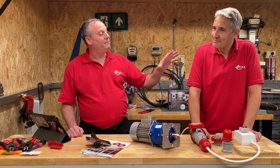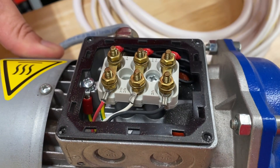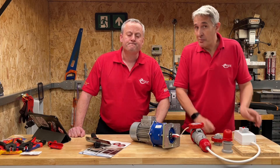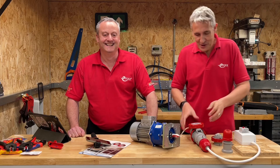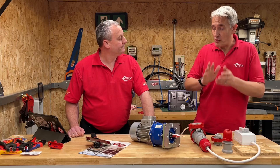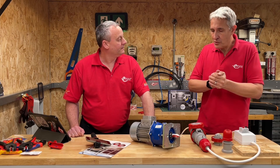I would suggest on-site you are paid by the hour, so if we take the cover off here and disconnect two of the phases and swap their positions, we can change the direction of the motor - all that process could be done in the plug itself. And if you work in plant maintenance you've got to make that process sound really complex so you can take a long time to do it, but this product that I didn't know existed until Skarmie sent us one makes that process really easy if you're in a situation where reverse phases can cause a problem.